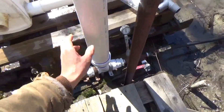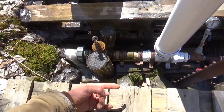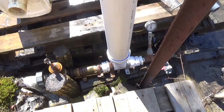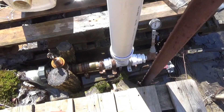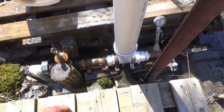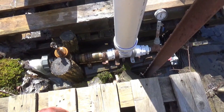It pushes through that check valve and is trapped in this chamber. From this chamber it goes out to the output line. So on each cycle we're trapping a portion of the water and pressure being produced in the chamber and delivering that to the rest of the system. They usually run about 10 to 15 percent efficiency — so for every 100 gallons that goes through the pump, you'll get about 10 or 15 gallons delivered up top.